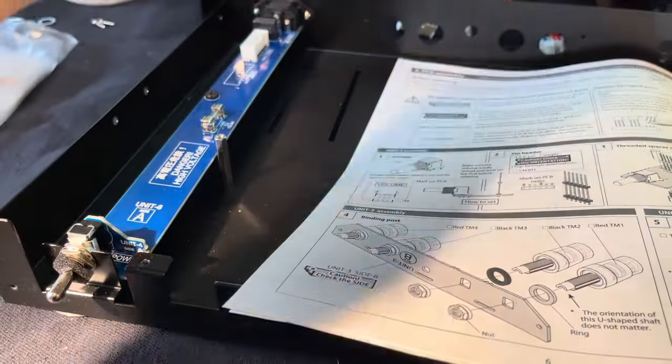They say in the instructions that they're very important to the sound and that you might want to upgrade them. They give you a fair amount of room — for example, this capacitor C104, the ones that come with it would go in that little rectangle there. When I first built the kit, I replaced those with orange drop capacitors, which are higher quality 0.1 microfarad. To fit this one I had to use the next set of holes.